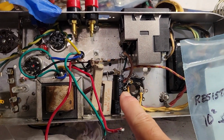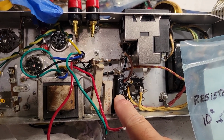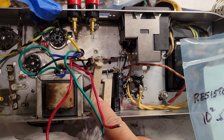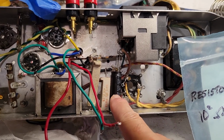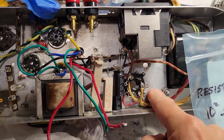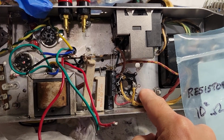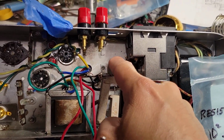But they'd be sitting right next to these capacitors, which need to be kept cool. And so I'd have this buttload of heat dissipated out of these things sitting right next to these capacitors. So that's really a no-go. I could put them way over here. That could be an option, but then I'd have to run relatively long leads. So that leaves me with up here.